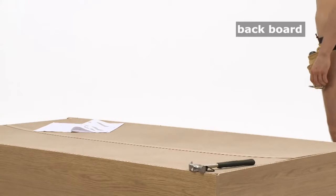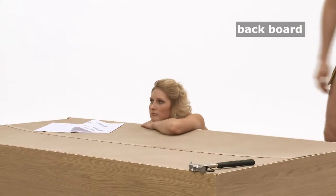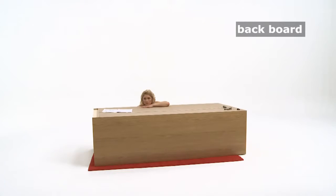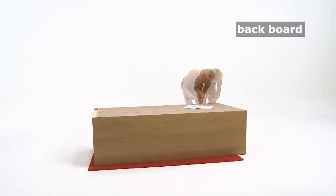When you have the 4 nails hammered in, 1 at each corner, it's time to go around all 4 sides, hammering in the remaining nails. There are over 30 of these. Space them as evenly as you can, but importantly, don't skimp on these nails, because the backboard, once securely in place, adds greatly to the strength of the frame, and this ensures that the doors and shelves will attach easily.